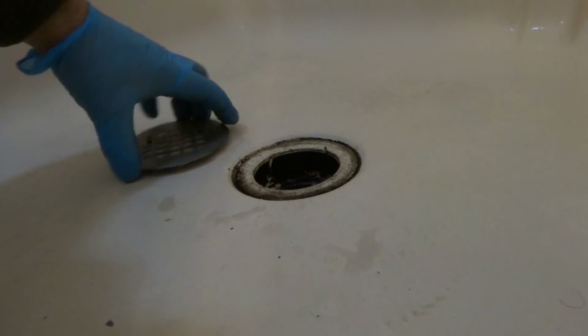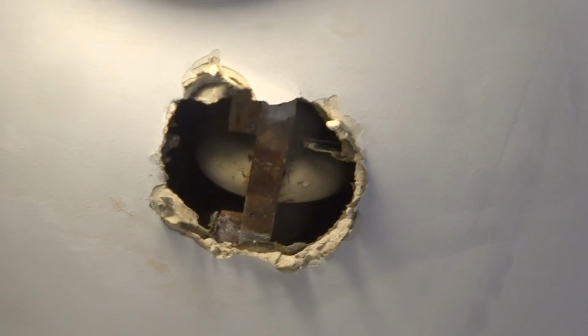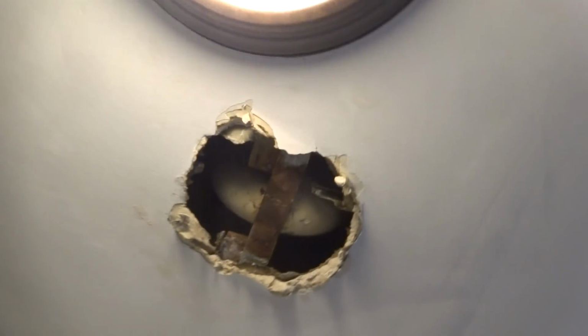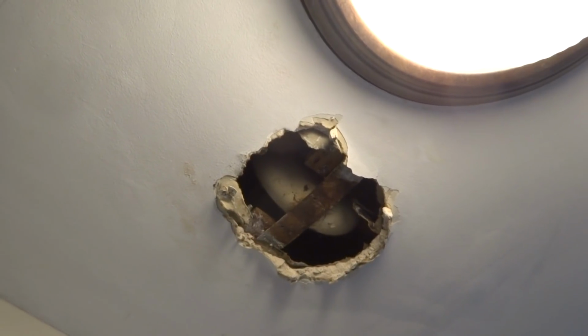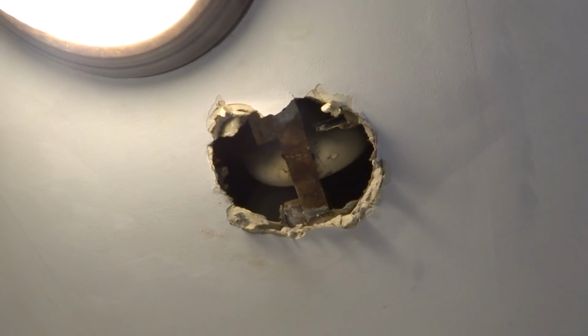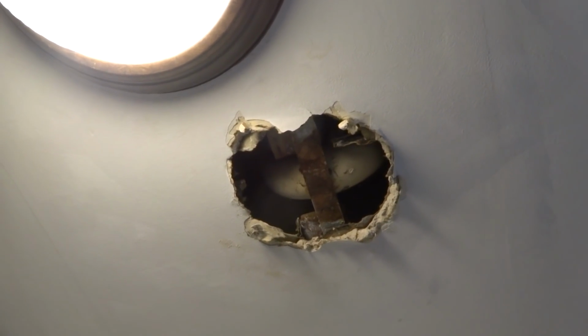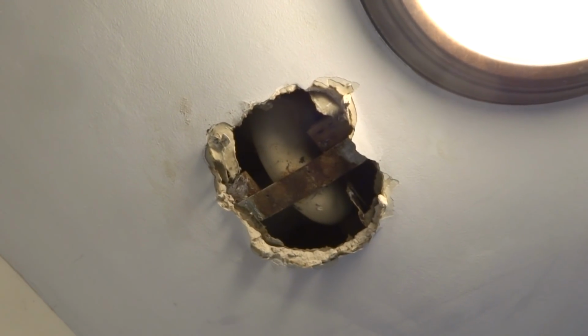I'm gonna make a hole in the ceiling downstairs, right? And we'll run it. Alright, he's gonna run it, and we're gonna see that drain was loose. I did tighten it up top, about 3/4 of a turn. I don't think it recorded, but the drain was loose as a goose up the top. I put my electrical cutters in there, snip wire things, and was able to, with a screwdriver, tighten it.